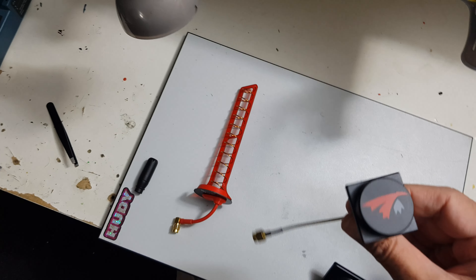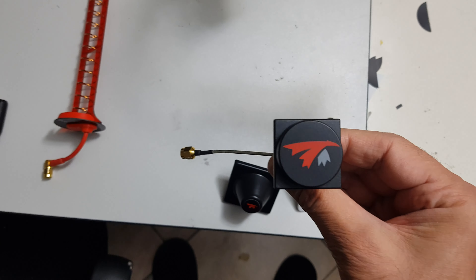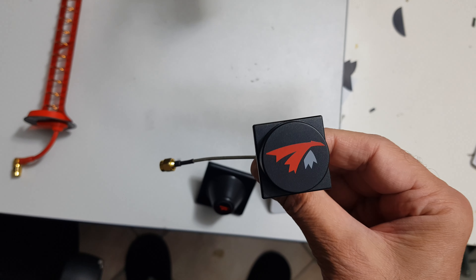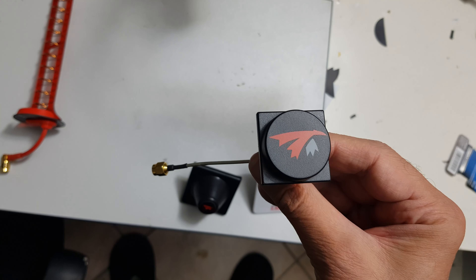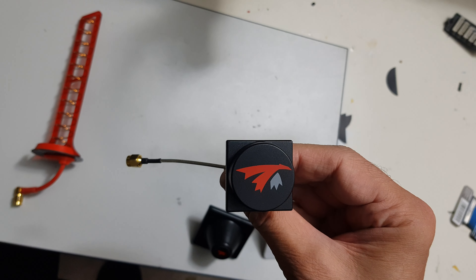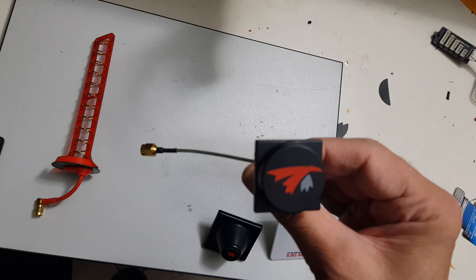This one is another antenna from TRU-RC, it's the XR, and this one isn't exactly a long-range antenna like the others. It has slightly less gain, but a much wider beam, more suited for mid-range flights where you have to move sideways and not only in a straight line.